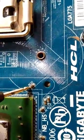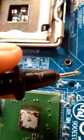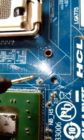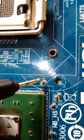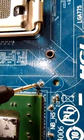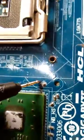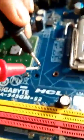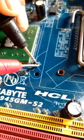In the second method, the black probe is ground and you check both sides one by one with the red probe. One side shows a value and the other side gives a big beep, which means this SMD non-polar capacitor is okay. Now let's check with the multimeter — connect both probes to both sides and check.